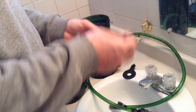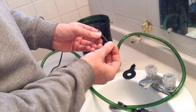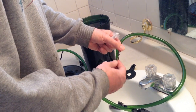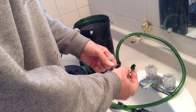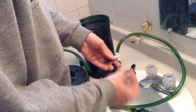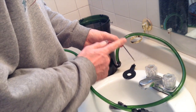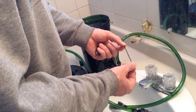So what I did, I went to my local hobby shop and bought a piece of brass rod. The brass rod as purchased, which was 3/8 inch in diameter, was too thick. The size down from that was too thin. So I cut the brass rod to length, put it in my Dremel, and spun it while sanding it with 400 grit and 600 grit sandpaper.